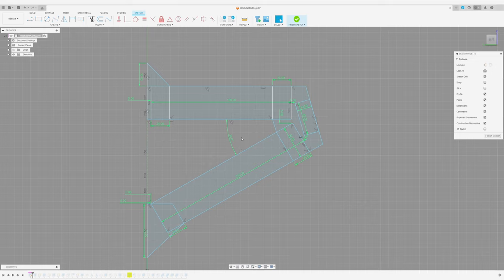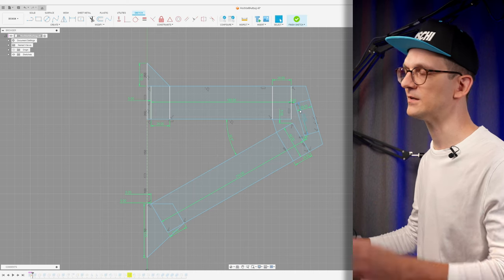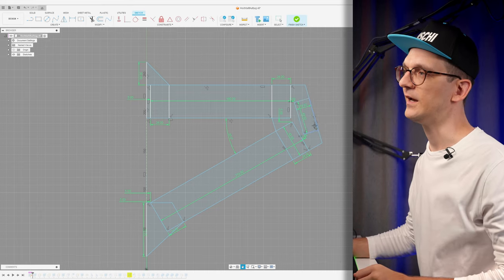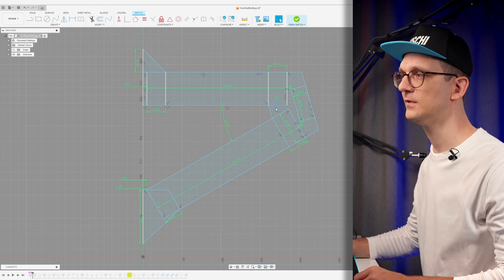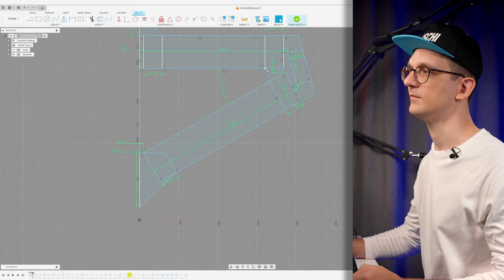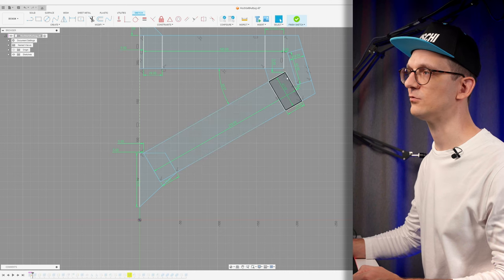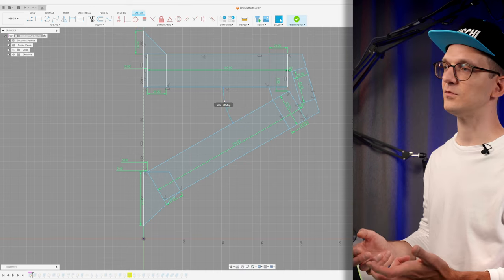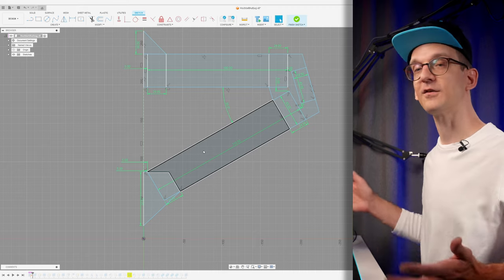They are both angled at 30 degrees — that was a compromise. 45 degrees would be ideal because the force vector from a rope coming down and running parallel to the beam would bisect that 90-degree angle, giving a 45-degree resultant. 30 degrees is a compromise to take enough load and be stable, while not giving away too much length, since I was limited by the size of the wooden piece I had available.